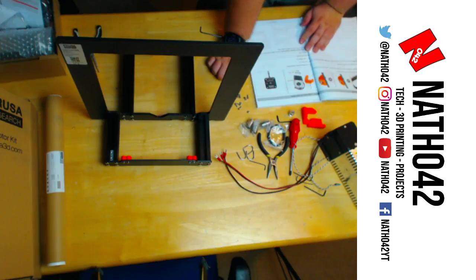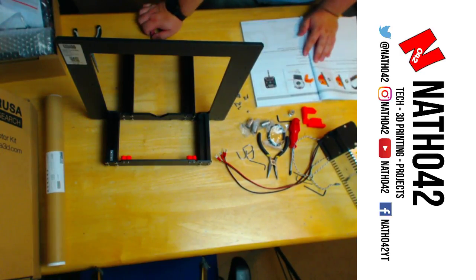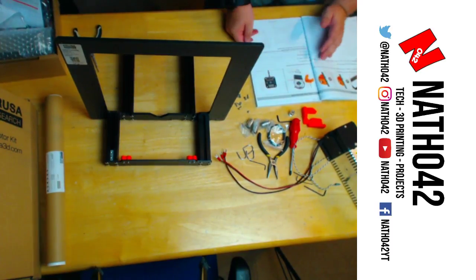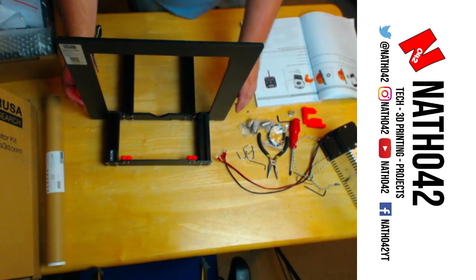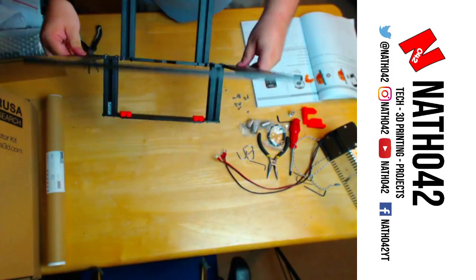Mounting the Y belt idler. Oh, I've just done that. Wait, did I? Did I do it wrong? No, I did not. Sorry, it says on here about there being a gap, but there is no gap. Rotate the frame with the longer extrusion towards you. Perfect, yeah. There we go. Take the Y belt idler and place it on the front plate. Note there is a marked circle on the printed part facing up. You know what, I got lucky and I put that there. I did not notice that it was there before. Also, I do not know what the difference would be.